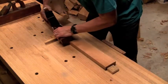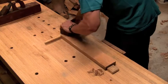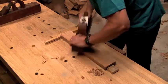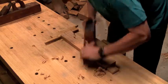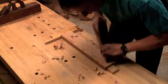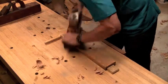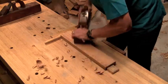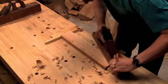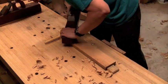Now I'm going to reduce the thickness of a piece of oak by an eighth of an inch. Once again I use a jack plane for the bulk of the stock removal. This plane has a more moderately cambered iron and is set for a shallower cut than I would use on a soft wood. A lighter cut means it takes a little bit longer with the jack plane to get down close to the gauge line.